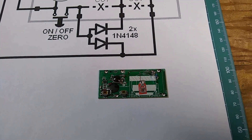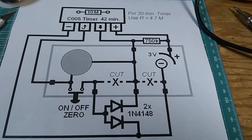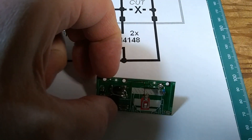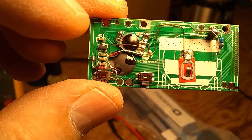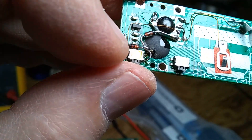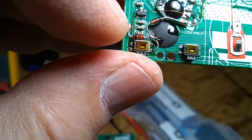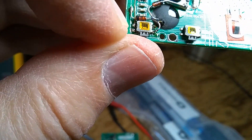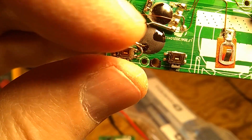This is the finished board, and I added the little timer next to it. According to the schematic, this is the timer, and this is the 10-meg SMD resistor right here at the tip — a 10-megaohm resistor for timing, 42 minutes. You can see the trigger wire — a little thin wire — goes to the bottom part of this switch. This is a membrane switch with four pins, but two and two are connected together, so it's actually two-pin. The two diodes go to the top terminal of that switch — one goes to ground, the other goes to the minus of the timer board.